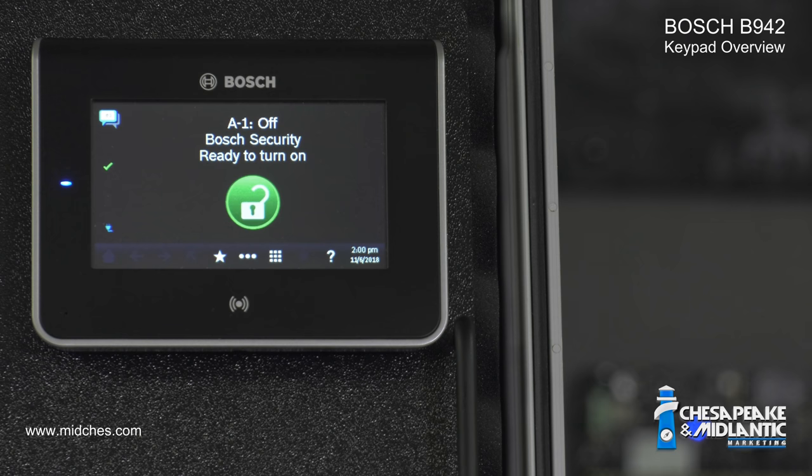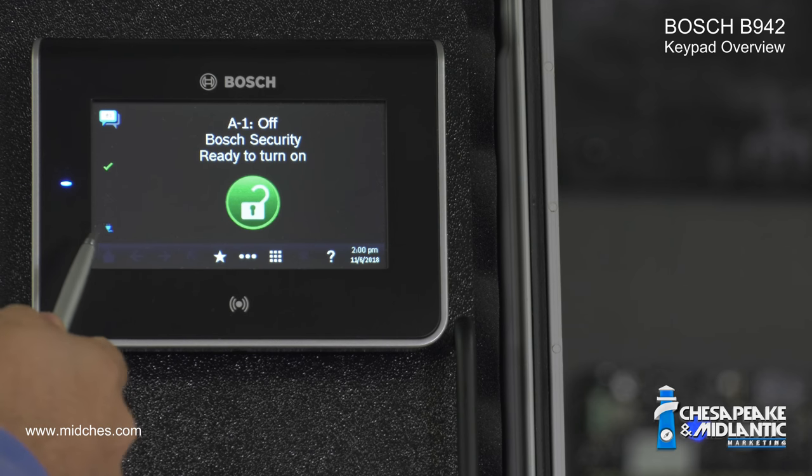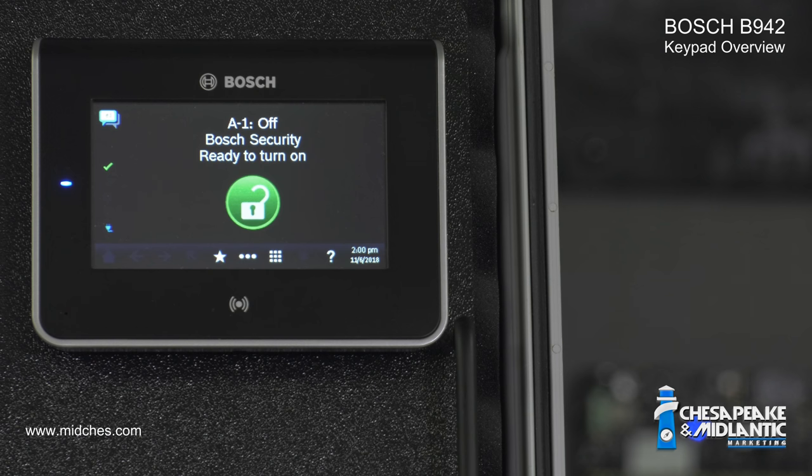The fourth indicator is the word 'gas.' If it is flashing blue, you have a carbon monoxide leak and you should evacuate the premises immediately. It's important to note that not all alarm systems have a carbon monoxide detector installed and connected to the alarm system. The last indicator is a power plug. If it's solid blue, your alarm system has AC power and battery backup power. If it's flashing blue, your alarm system is running on backup power and only has a few hours of operation left. Contact your alarm company if your alarm system is ever running on battery backup power for over an hour, as the battery may need to be serviced or replaced.